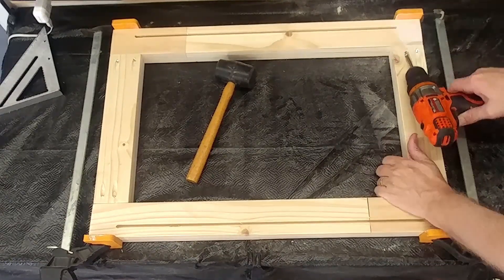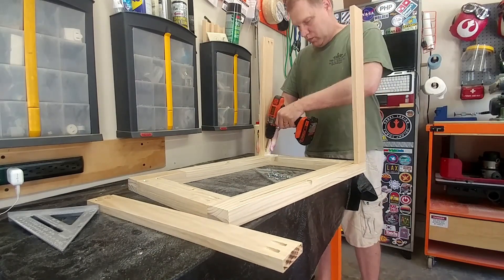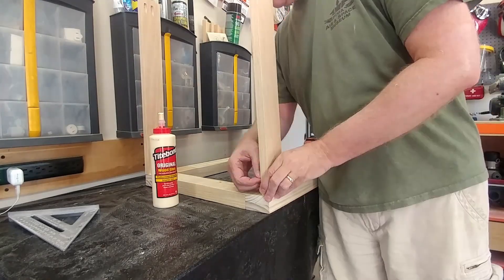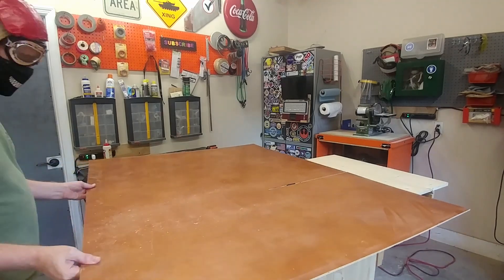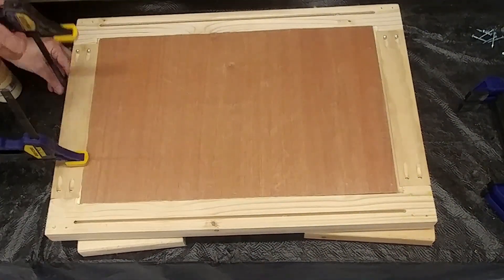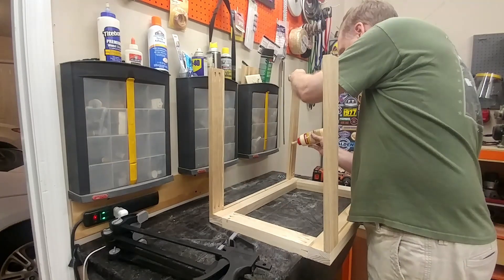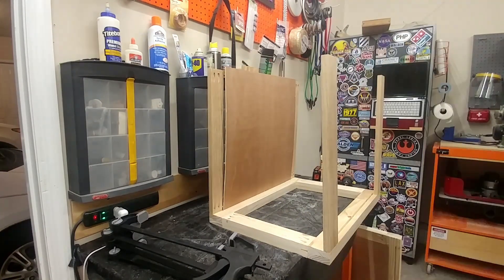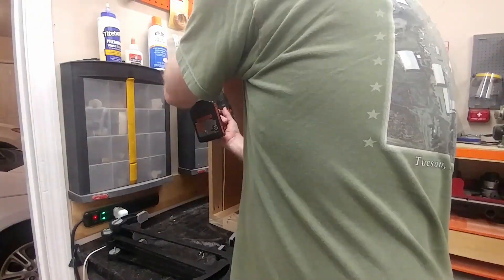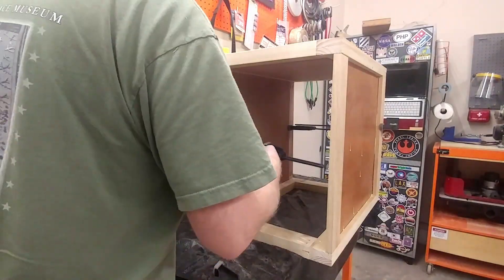This piece is the front of the safe. The large opening is for the door. With the front of the safe still lying face down, I attach the supports that will form the left and right sides of the safe. The back will be attached to the top of these runners. This is the back piece for the safe, and I'm applying glue inside that notch we cut with the router earlier. Now we just lay that plywood down in the hole and clamp it to form the back of the safe. Then the left and right sides go in: wood glue first, then the side is dropped into the notch cut by the router. Once the sides are in place, the back is put in and screwed into place with pocket screws. Everything is clamped down to give the glue a chance to hold, and then I go have dinner because it's going to take a while for this to dry.